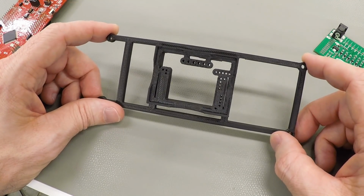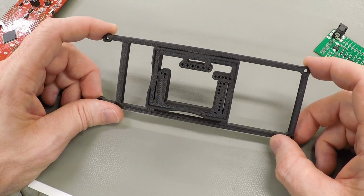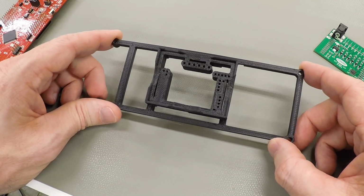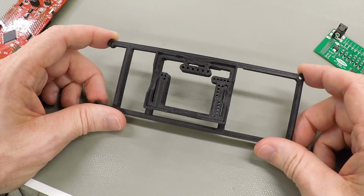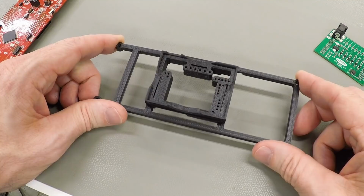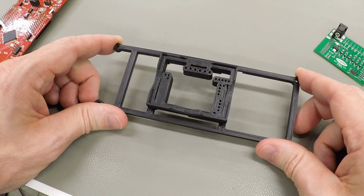Now, any 3D printing technology that processes the material hot is gonna suffer from this. The part's gonna get smaller when it cools. That applies to fused deposition modeling, like my printer. That'll apply to selective laser sintering. It's going to apply to printers with a heated chamber because the part will be kept hot longer and not warp, but then when it cools, it's still gonna shrink.